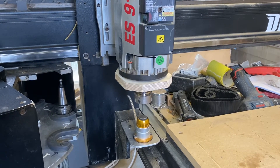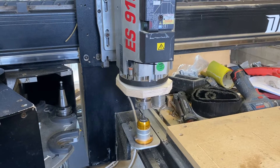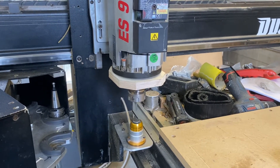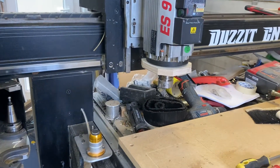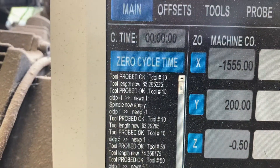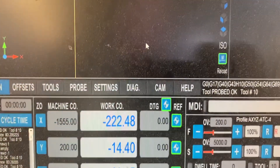The extra move is so that it moves away from the probe. For a normal move it's away from the probe. That's the tool change finished — it's automatically set it and probed it, and it gives me the probe height. Everything's set and ready to go.